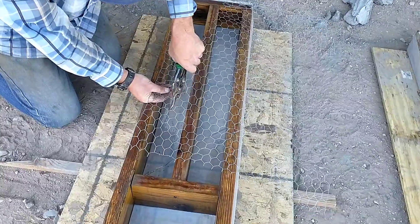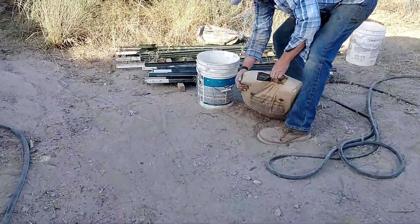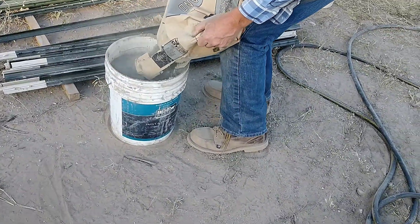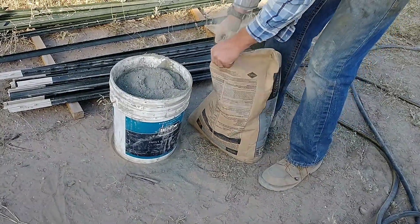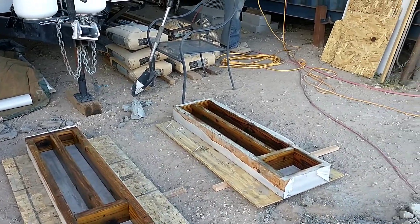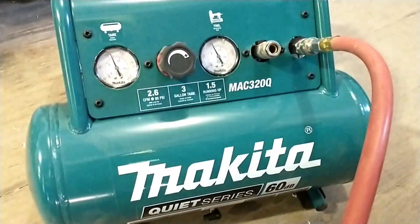Here I am getting the chicken wire and ribbed wire cut out and prepped. There was a local shortage of 47-pound bags of cement, so we had to buy the 94-pound bags and split them in half and weigh that out to make sure it was accurate — a little extra step but not too big a problem. We're doing all our normal prep work, getting the forms ready and cleaned. Here we have two sample boxes ready, oiled up and prepped for the two batches we're making with wire reinforcement.